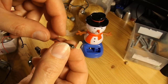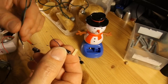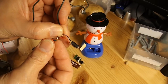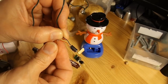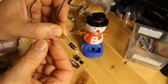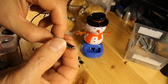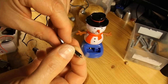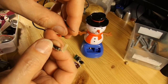I've got one of those little pager motors — I actually get them out of vibrating toothbrushes. I'll give it a try. Nothing, not even a beginning of a movement. With a three-volt battery it works fine, but the one and a half volts I'm getting from the potato is doing absolutely nothing. There's just not enough current.